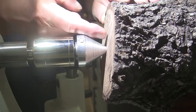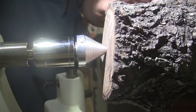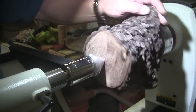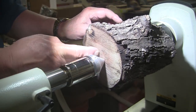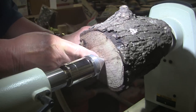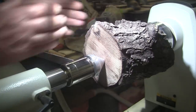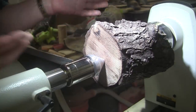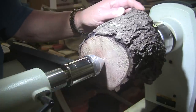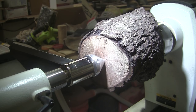Then I'll switch it back around, drill a hole up here for the woodworm screw, and we'll start working semi-normally. I hope this works — it seems like it shouldn't come out of there. I've got a good firm point here embedded into the wood, and the other end setting against the flat top. I don't see how it could get cocked out of there and fly out. 540 RPM, 5/8 inch bowl gouge, mask and face shield on.